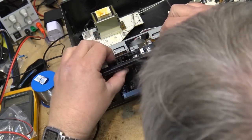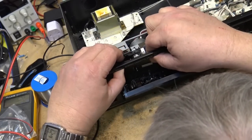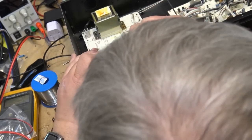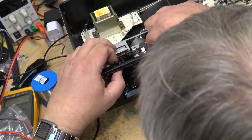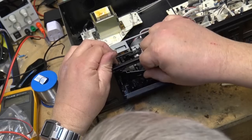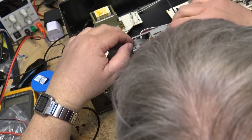This should lift out, so that I can get to the tape hub in behind and replace the belt. So we just have to kind of work at this a bit. It'll lift out. I just have to clear all of the tape switches and sensors and stuff that's in here for detecting the type of tape. And it'll lift out. It should anyway. Not that I need to really go much further than that, because I can access the gear here to clean the crud off of this one from the remains of that belt.